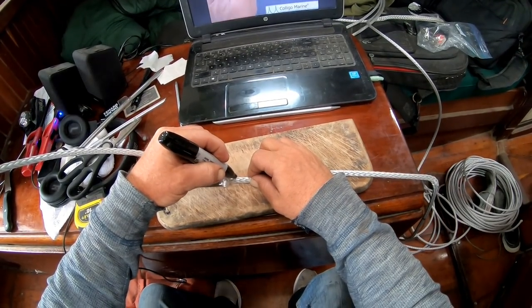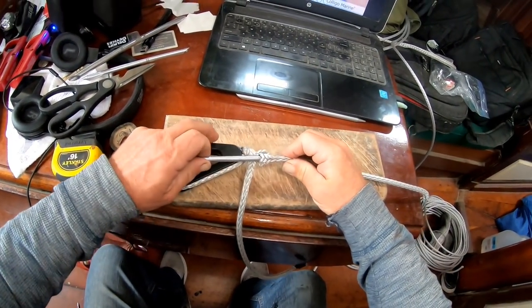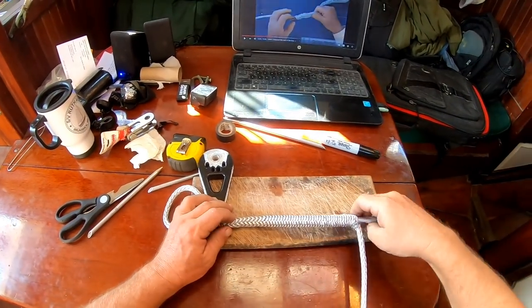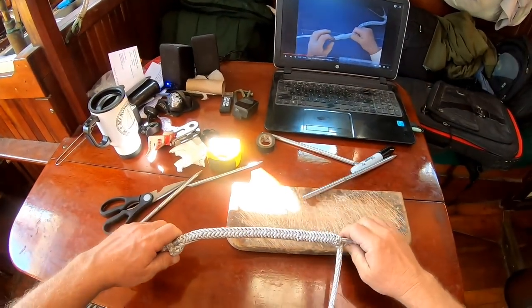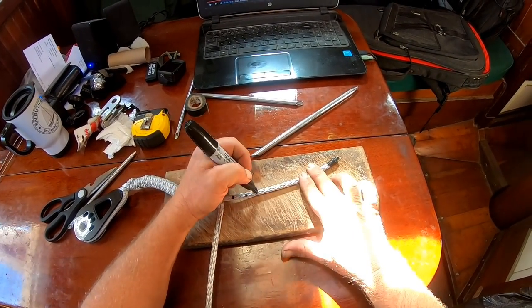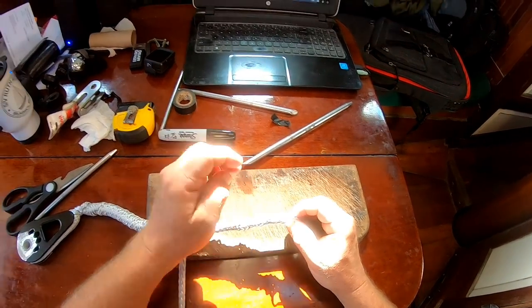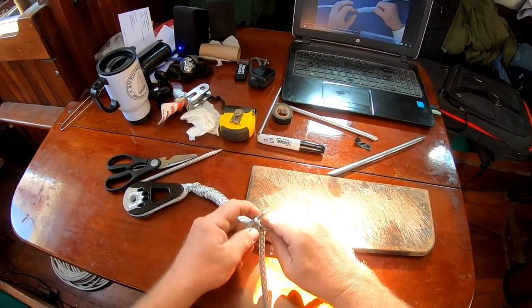After a week and a half of grinding thimbles, it's time to get splicing. Splicing Dyneema Dux is actually fairly simple. Colligo Marine has a three-part video series on how to do it, which is what I'm watching. You have to tie a certain knot that goes around the thimble to prevent slipping. The last part is to bury the tail inside the weave - I use a long fid to feed it inside. Finally, you have to taper that buried tail by pulling out strands and cutting about every three-quarters of an inch, so you get a nice taper - otherwise you'd get a sharp rise which could weaken the Dux.